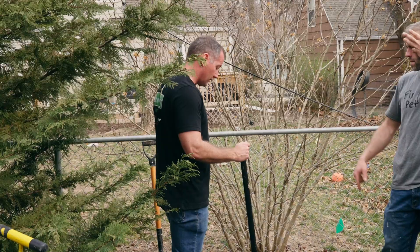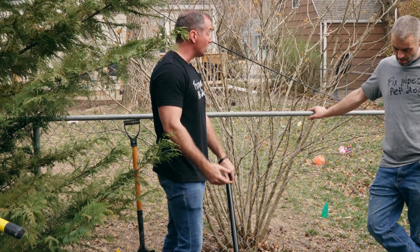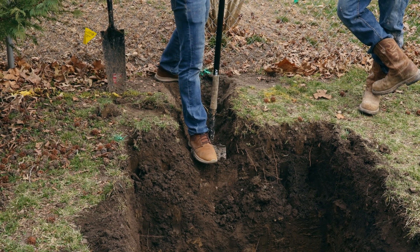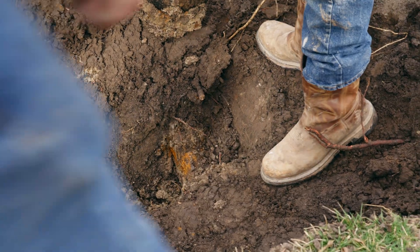We'll be at a new elevation — somewhere around eight feet deep, high sevens to low nines. The locator was jumping around a little, but we just keep doing that all the way down until we find the gas line or we don't. If we get three feet deep and haven't found it, we go to four. After four feet, if still nothing, we'll say it's not on this side of the fence. That's an old steel gas line. Tomorrow we'll get this whole job wrapped up, get their brand-new sewer installed, and get everything buttoned up in one more day. Now you've seen a quick tutorial on how to get started with an excavation when you've called in locates, and how to dig around those locates and find them underground safely without damaging anything. Until next time.